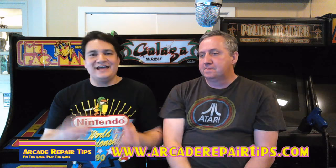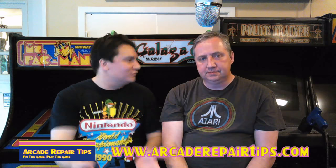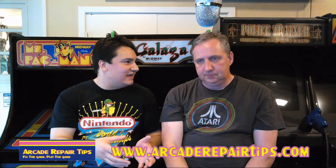So what does the renew kit do? Well, basically the sockets on Galaga boards just die all the time, or they come unsoldered or have all sorts of problems. Even if you replace a socketed chip, you may still have problems because the socket may be bad. What the renew kit contains is brand new sockets for all the socketed chips, and it actually gives you some sockets for chips that aren't socketed already. By doing that alone, sometimes you can fix a lot of these problems. Like the video RAM that he's got, the sockets may be bad on some of those, which may be why he's experiencing this issue.